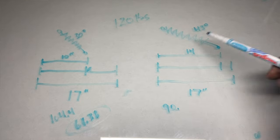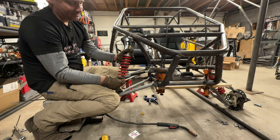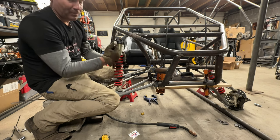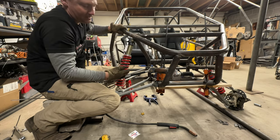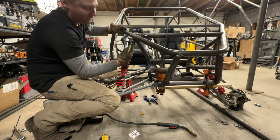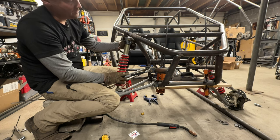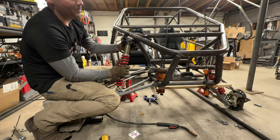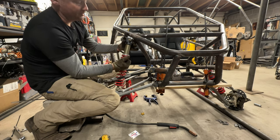I did a great video on shock math, and that's in it. As you lay this down, your springs become less effective. The more you stand it up, the more effective they are. So instead of coming in here and reducing my shock to like 60% of the spring rate, I'm bringing it out here and I'm still probably gonna get 90, 95%. Anywhere before you hit, if I remember right, it's like 18, 20 degrees, you're still getting a good chunk of that.